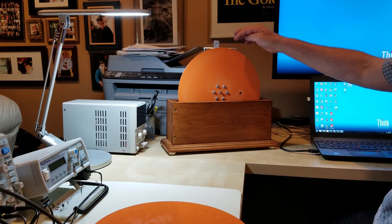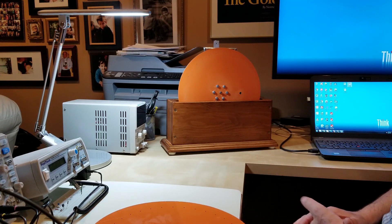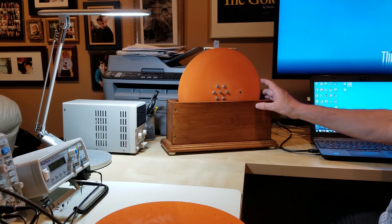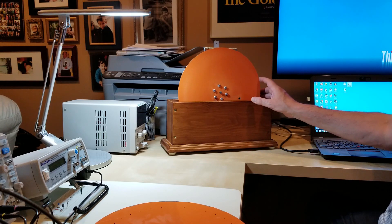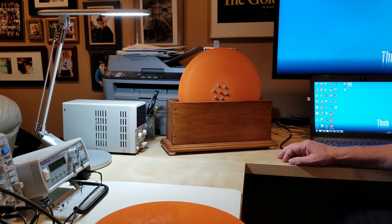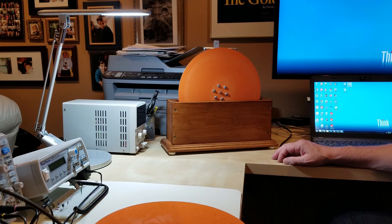Behind the disk is an LED light. Back in the day they would have used a neon tube, which would have been monochromatic — orange, in fact. In this case I'm using three LEDs: one red, one green, one blue. With a little diffuser box I made out of some tape and cardboard, by modulating the light from the LED as the hole moves across the diffuser, the TV can produce different light intensities at different points on the screen. This is essentially the same way that a cathode ray tube TV works, though CRTs are more or less obsolete now. But in the 1920s, this was really the only way that existed to make an electronic image of any kind.